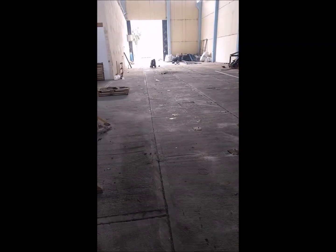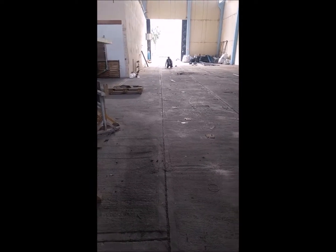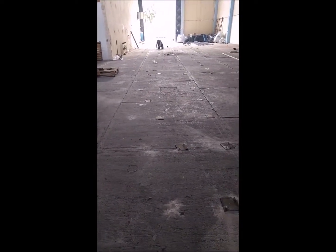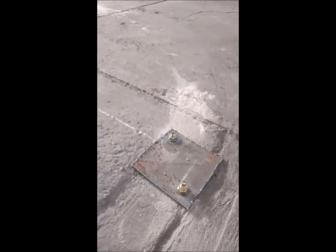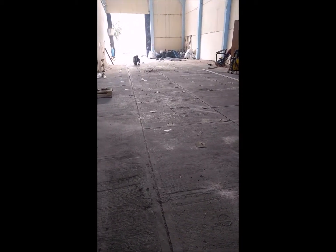We'll see if we can give you a little more sense of scope and scale. If you look down the line here and see all of these metal plates that are being bolted to the floor, we're right up here at the bow. This is the furthest piece forward. These things will have steel rectangular tubing welded to them, so legs to raise them up a little bit, and then all of those will support a kind of framework or a table, and that'll be the jig that sits on top of all of this, and then the aluminum frames, as we get them in, will start